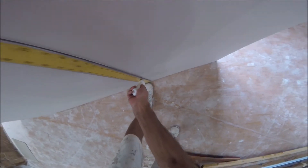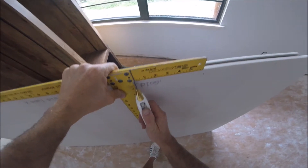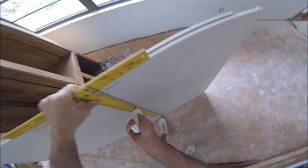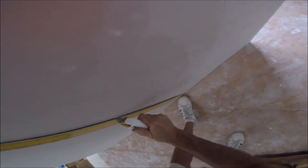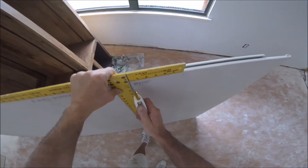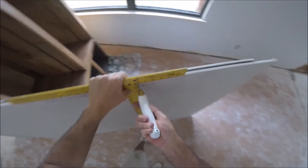What I'm going to do is score this about five times. With a piece of half inch you can score it once and snap it, or cut the back — you just have to apply a lot of pressure right on the point of the razor blade. For five-eighths, you may as well do it a few times, probably five times. All right, one more.